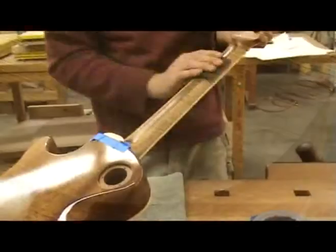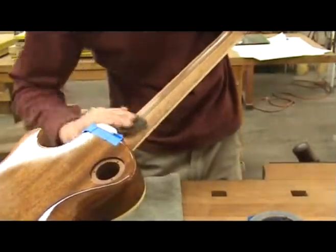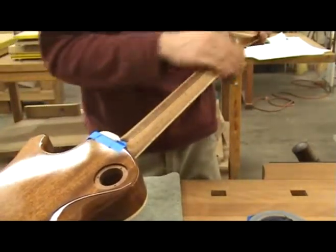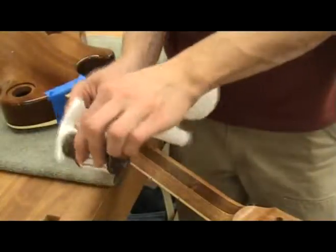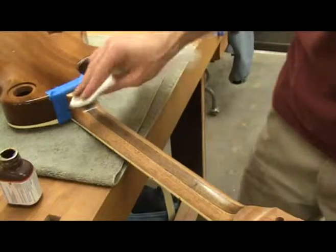As you can see, it makes for a very nice finish. To apply True Oil, make sure that the surface is sanded well and pore-filled if using an open-pore wood. Then just put a small amount on a clean, soft rag and wipe on a thin layer.